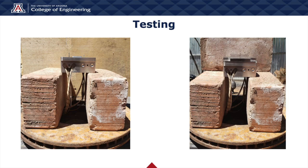For testing, we put the heating elements as well as the thermocouples into the heat plate as shown in the first image. We placed the build plate on top of the heat plate as shown in the second image and plugged the heaters and thermocouples into the control system. We then set the system to 60 degrees Celsius. The control system successfully operated the heaters and maintained the temperature at 60 degrees Celsius within 0.7 degrees. From this test, we successfully proved the functionality of the control system as a means to accurately set, control, and display temperature of the plate.